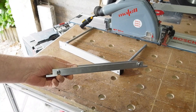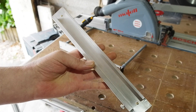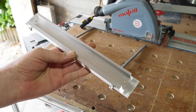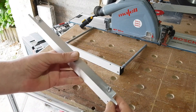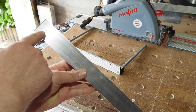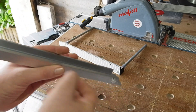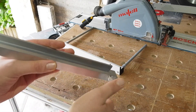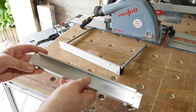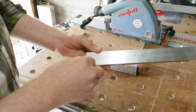That's where these beauties come in. I've had these machined in solid aluminium. In the base are two brass grub screws to adjust the height, in case you've gone for different rail grip options or to allow for slight inconsistencies in the saw and fence. On one side there are two small thumb screws to fix it to the parallel fence.